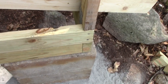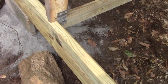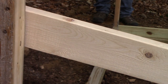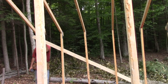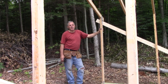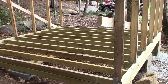Some of the floor joists hang over nicely, but some are off by more than a quarter inch — they just don't reach. We couldn't afford the Garden Time sheds, which are built like rock, and we didn't want the super cheap ones from Lowe's or Home Depot, which were 2x3 construction, 24 on center. Curtis Lumber at least was 24 on center with 2x4s, even though some of the 2x4s are missing so much on the corners that it's like a 2x3 anyway. We're going to strengthen it up by adding extra floor joists — definitely overkill, but considering we have a 400-pound ATV and a 400-pound wood chipper going in here, we felt it was necessary.